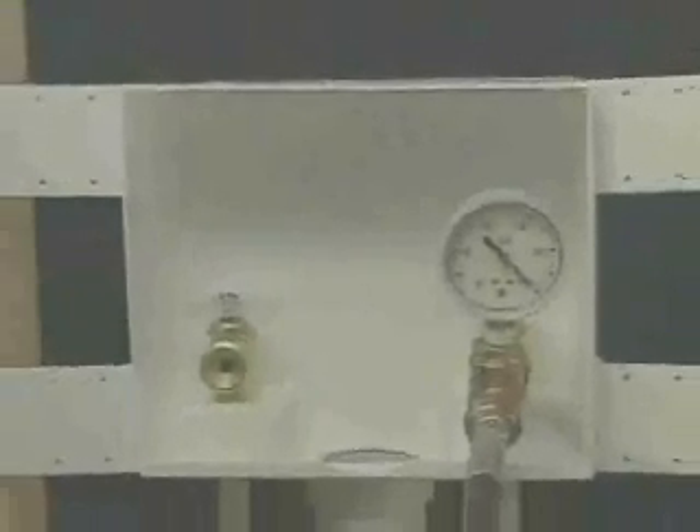Cut out any fitting with a leak. If for some reason you can't perform the recommended test, the test pressure should be at least the normal system working pressure, but not less than 40 psi. The test time should be at least 15 minutes.